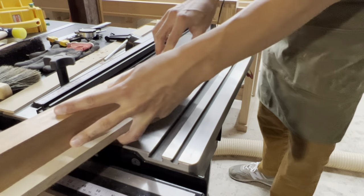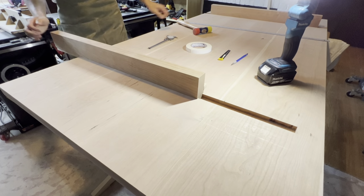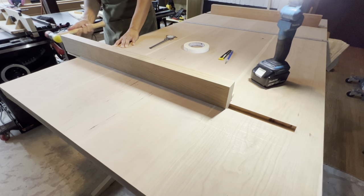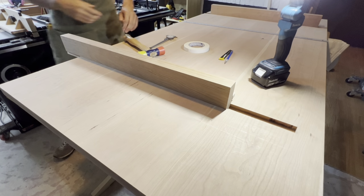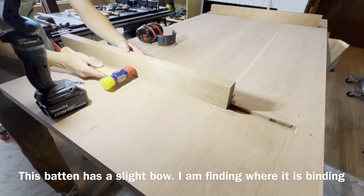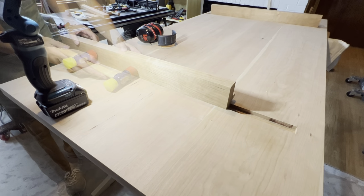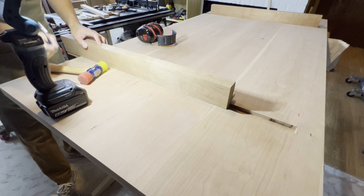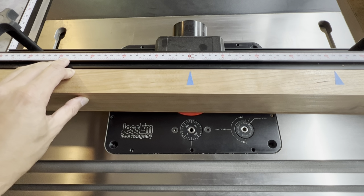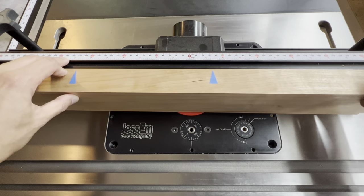In short, to ensure the taper is uniform on the leg as it is in the slot, I attach a shim with the same 1/16 inch taper over its 33 inch length on one side of the leg as I run it through the router table. With that critical step done, any additional adjustment needed for fitting can then be done on the non-taper side. With this type of joint, removing a tiny amount of wood really does change the fit in a drastic way.